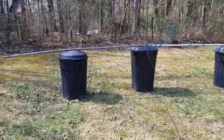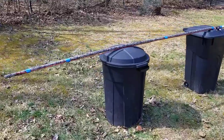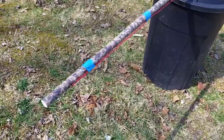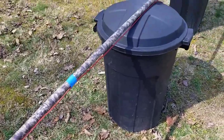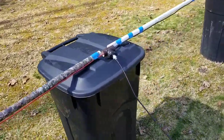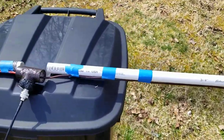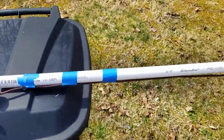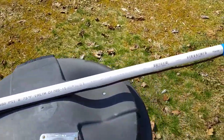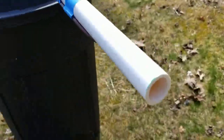This video today, this is Foxman 362 World Radio on YouTube. So this is the one I showed you — that single beam I did back a few months ago. I think it's between 101 and 102 inches, but it's a little bit off. I did the trimming last night and readjusted today when I re-taped it up. It's down to 1.1 on the SWR on both channels — channel 40 and channel 1. I actually heard Arizona coming in a while ago with this. Very quite good. I'm going to be putting it up to height real soon and I'll show you guys the result.